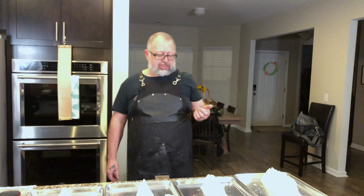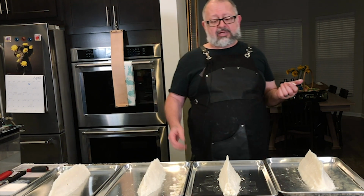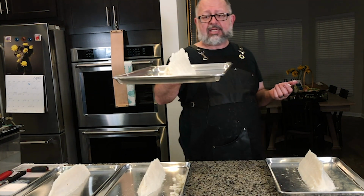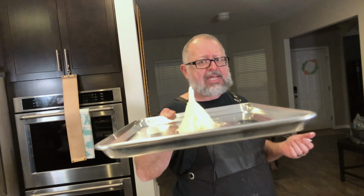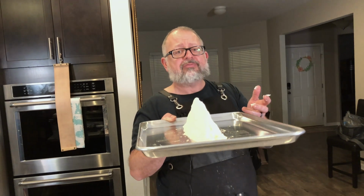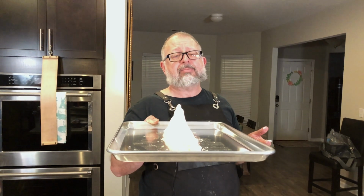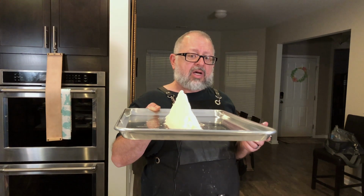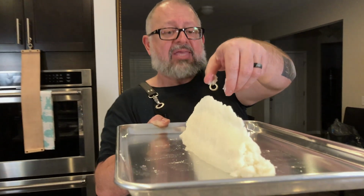So now what I'm going to show you is there are two types of burrs, okay? The two types of burrs we're going to call positive and negative. The positive is going to be a softer one. This type of burr, if you look at it, has a thin wire edge. You might think for a moment that that's a great knife, but actually you can even see it wobbling on the video. So what's going on is you've sharpened soft metal, anything with a Rockwell hardness around 59 or below. And in the description, I'm going to put some lists of different types of metal that tend to make this type of wire edge. So with this burr, you have somehow managed to make the burr stand up.